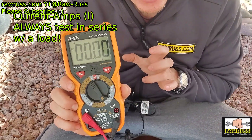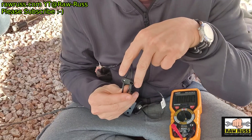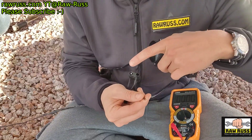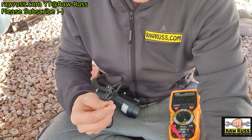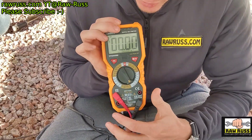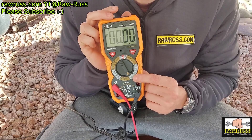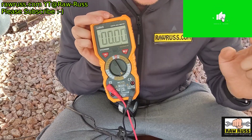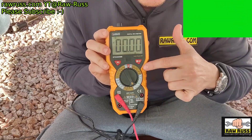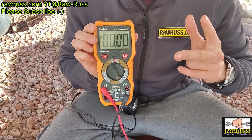So we were just testing voltage, but for amps you would plug it in there depending on high amperage or low amperage. Now when you're testing current, which is amps, you want to test it with the load in the circuit. You want to test it in series, not parallel. So for current, for amps, we're not going to put the two test leads straight across here because that would be in parallel. We're going to do it in series with the light in there — from the light to the main power wire. So we're going to test right here and right here. Always start high and then work your way down, because you don't want to blow the fuse of the multimeter or destroy the multimeter.